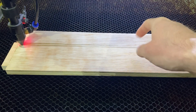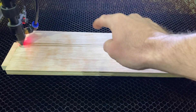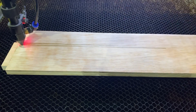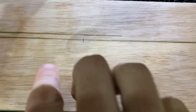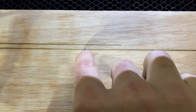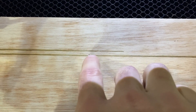Now what we're going to do is move the laser head and find the thinnest spot. Put the laser head right over that, and then we're going to measure the distance between the cone and our thinnest spot. I've looked really close at this line — you can see where it gets thick on one side, then thick on the other side. I've come right here in the middle where it starts to get thin, and this looks like the thinnest line. That's where we're going to move our laser head.